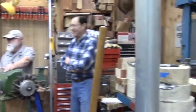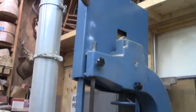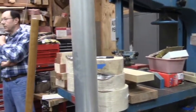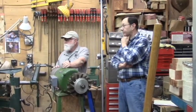They get really pricey when you get above 5 horsepower. So I think 5 horsepower is probably the cutoff for practical. Then you really are starting to talk about buying a rotary phase converter for it. And even they're not cheap, so unless you make it yourself, that's another adventure.